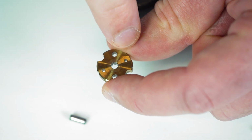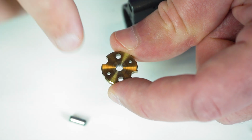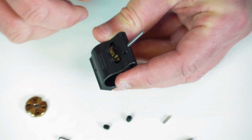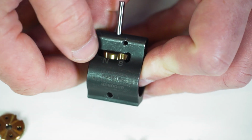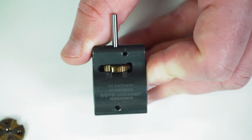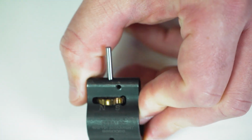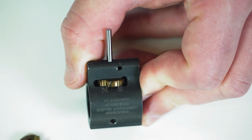So in conventional plates, we currently have 4 thou spacing between these 2, and on low back pressure, 8 thou spacing between the 2 hole sizes. And the smaller hole has the no notch side of the plate. So when you're selected to S, as shown, you're in the suppressed mode, smaller hole side of the plate. Normal, of course, is the same size on both sides of the plate. Then if we have a problem with operation of the suppressor, we can rotate the plate 180 degrees to suppressed on the larger hole side with the notches. And if we take the suppressor off, we can go back to normal.